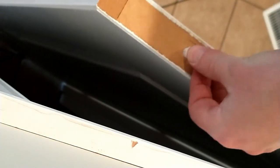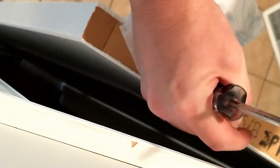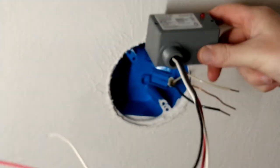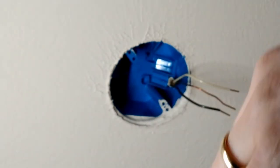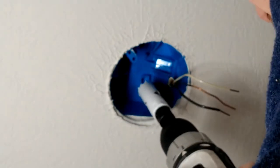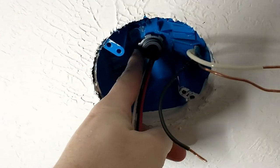Here's our magnet — we'll just put it in that hole. There's our magnet, and there's our sensor — you can barely see the two in there. Lined up nicely. This module is going to go on top of the blue junction box up in the attic, and this fitting is going to come through it. All I'm going to do now is drill a 7/8-inch diameter hole right in the center. After drilling that hole, I inserted the module from the attic and put this retaining nut on it.